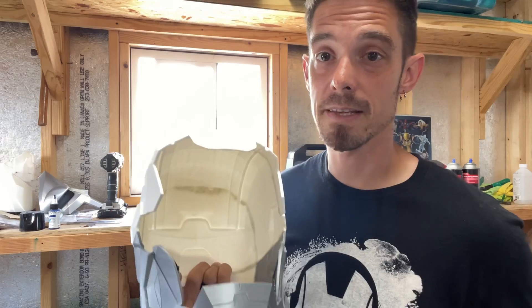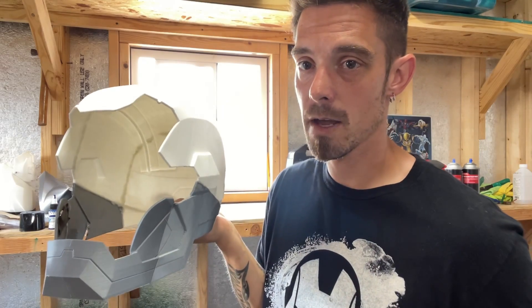Basically what we're using today is a magnetic reed switch. What this is, in theory, is a wireless switch that has two pieces of metal, and when magnetized those contacts come together, it completes the circuit and turns the light on and off. Just like on this helmet — I have a small magnet tucked away on the left-hand side of the mask.